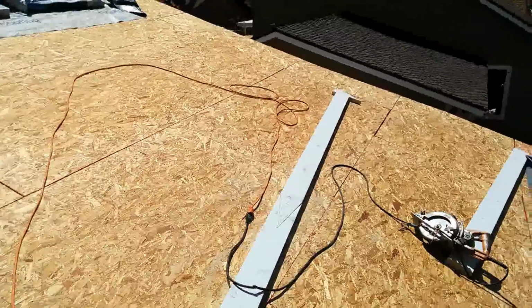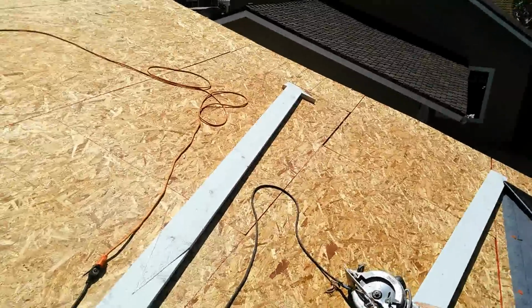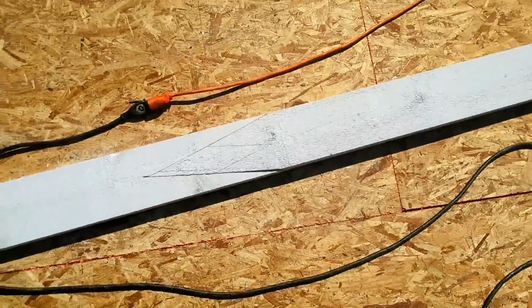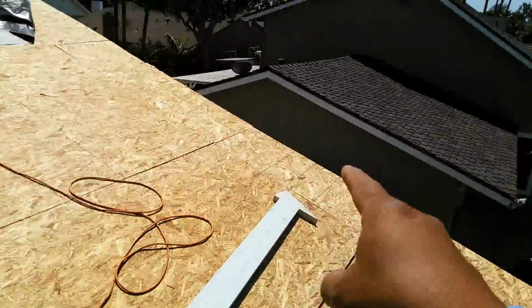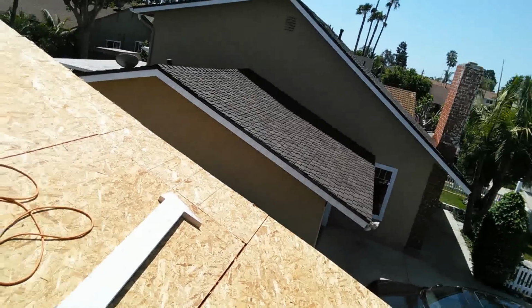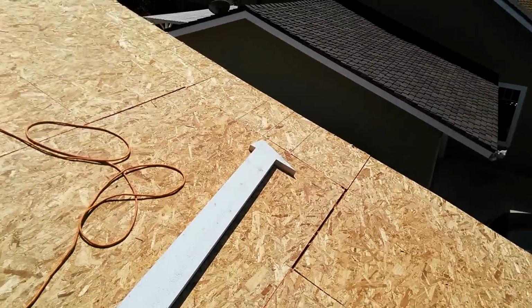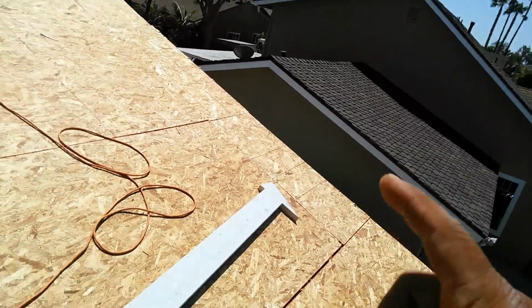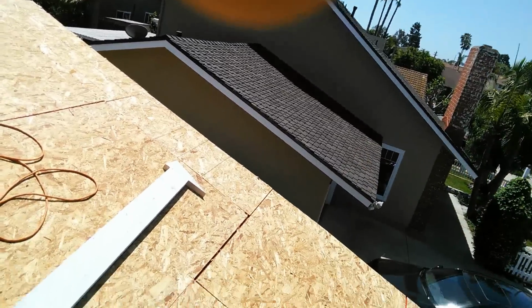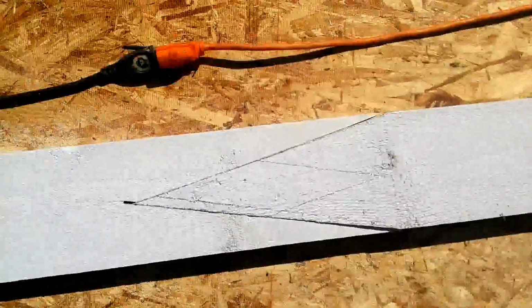Hey, YouTubers, before I forget, today I'm gonna show you a trick about fascia board. Some people, when you have this fascia board, it's about 27 feet, and they don't make it in 27 feet unless you order a special order, and it costs you a lot of money. But if you wanna make a long fascia and you don't have to do a 45 in the middle, just do like a, how do you call it? I splice it like in a V, like this. You see how we did it?